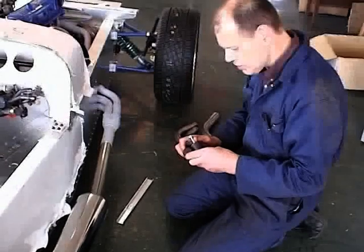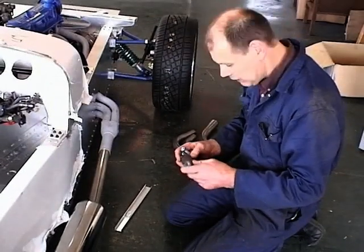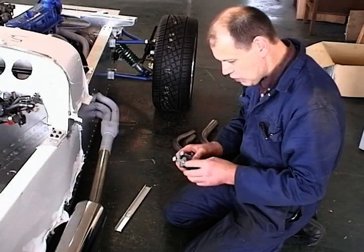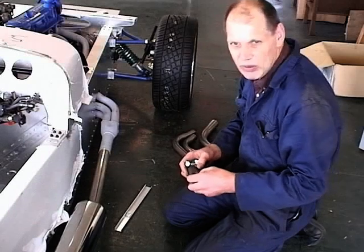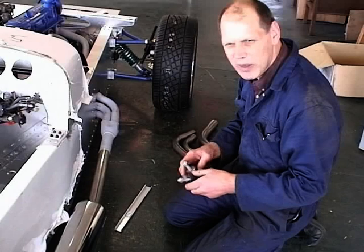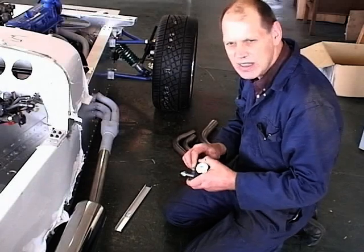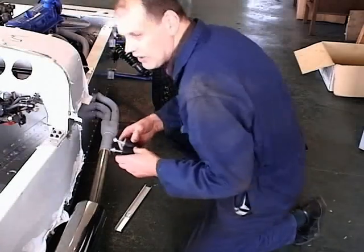But these rubber mountings, they're sold very, very cheaply by Robin Hood. In fact, they're sold at cost price, simply because they have been made abroad in China and all places, and we have had instances where the welded stud does snap off. If you overtighten that, then it will snap off, or we have seen it snap off. So don't tighten it too tight. We do sell them at that budget price because of that reason. Rather than send them all back to China, we decided we'd pass them on to you at what they cost to us.